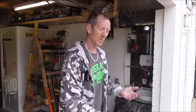Minimum load is half a cube, which is what I'm getting, and it will do all this. It's quite a lot, it's half a cube, which will be 1,000 by 1,000 by 500. Measure your area, depth, width, length, and it will tell you how much you need in that cube. So take for example, you want 5 metres length by 1 metre wide and 100mm deep. That will be your half cube. Now you can work it out for yourself.